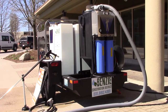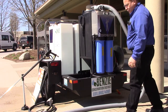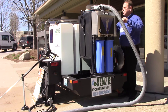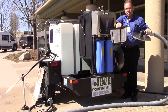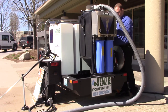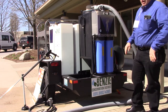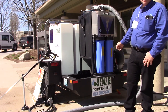The vacuum wastewater goes up into the vacuum assembly. After hot water pressure cleaning the boat at 160 to 180 degrees — you want to hit the boat at 160 degrees — the water passes through the first stage of the recycling system with the hydrocarbon absorber. It's then vacuumed through here into a lid that's easy to remove. This is where you collect a lot of the heavy solids — zebra mussels, etc. There's also a cone-shaped solid separation tank that lets heavy sediment settle to the bottom. There's a side drain to remove heavier sand or material. Use an empty five-gallon bucket to manage the zebra mussels that collect there.